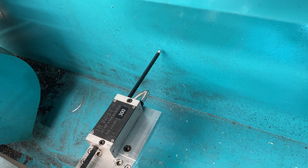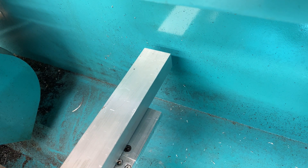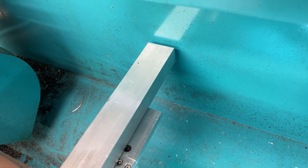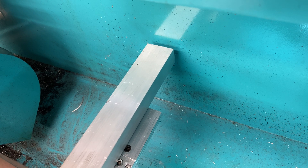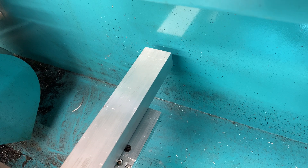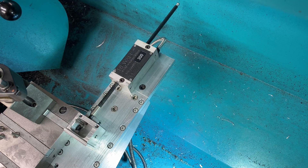I've made the cover so it's just longer than the rod, so if I put it in place it will bottom against the back of the splash guard before the rod does. I'm also pretty much at the limit of travel for the cross slide, and it's unlikely I'll ever be this far forward. So I'm quite satisfied overall — the next step is just to use it as-is and see what adjustments or improvements I might need to make over time.